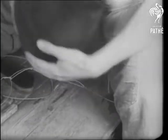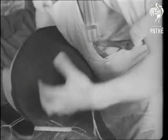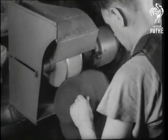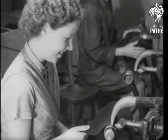When the felt has cooled off it's removed and you can see it's one of those tight-fitting affairs. Rollers covered with shark skin raise the surface of the material and give it a nap, and another machine trims the nap — or peach bloom as it's called by the experts — and makes all the ends the same length.